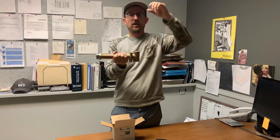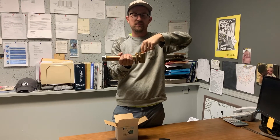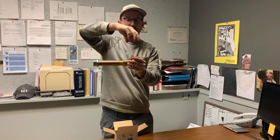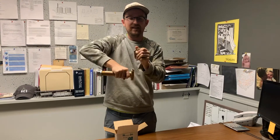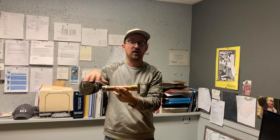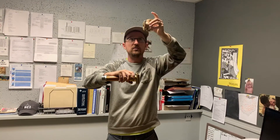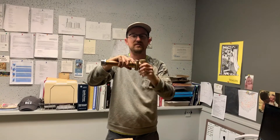On the blank side, from outside of the cistern you can thread a one inch threaded rod right into the top of this. You want to make sure this is mounted right below the manhole of the cistern so you can remove the cover, drop a threaded rod in from above ground, thread it in here, and then use that rod to pull up on this fitting — pulling up the pump with it. So you can pull the pump out of the cistern without having to unplumb anything. When you put the new pump back in, guide the one inch threaded rod into this sleeve, push down, and it locks back in. The weight of the pump holds it down and it's a watertight fitting.